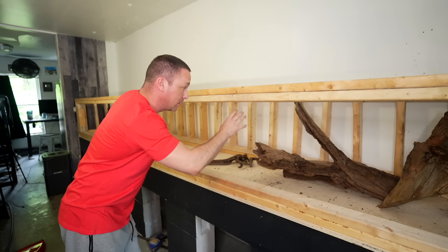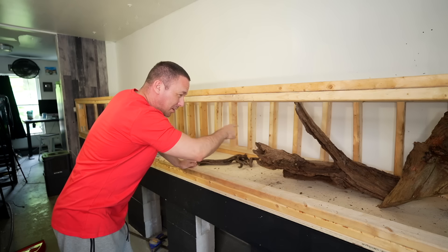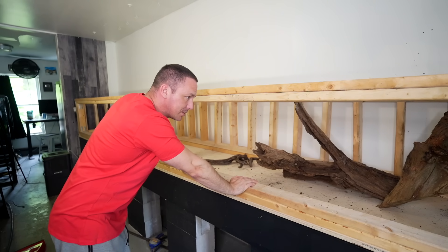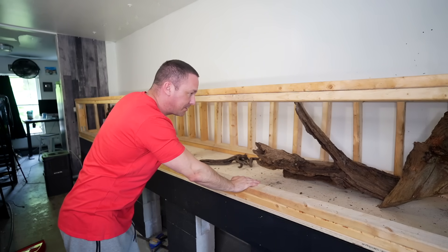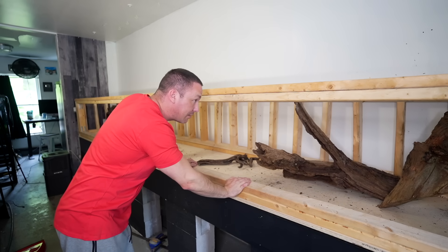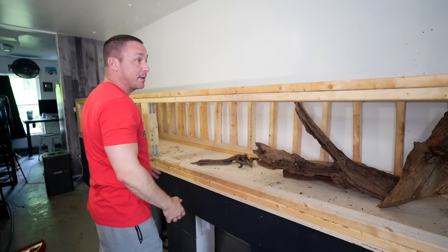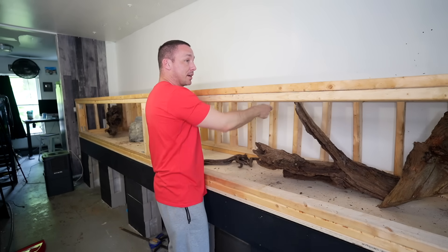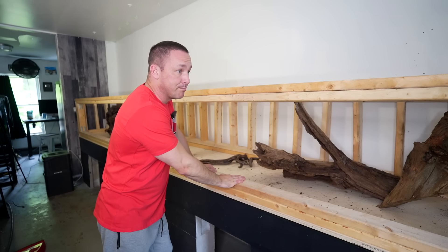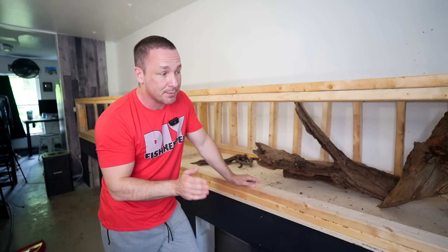This week we'll get the plywood, install it, put the first coat of epoxy down, sand all the corners, fiberglass those — put a fiberglass cloth down, epoxy it again, and then again and again if I have enough. Then sand all the front edges, sand the acrylic panels, silicone that in place, brace it with sticks.